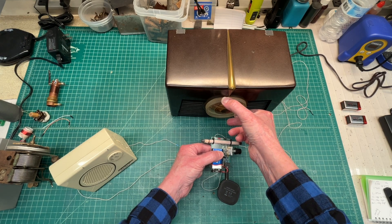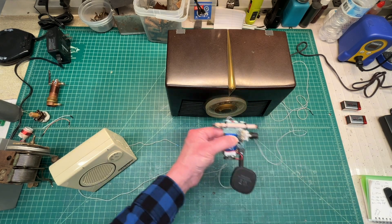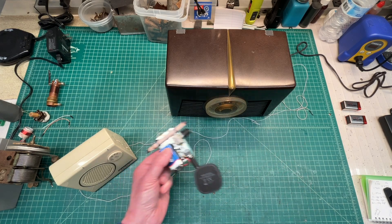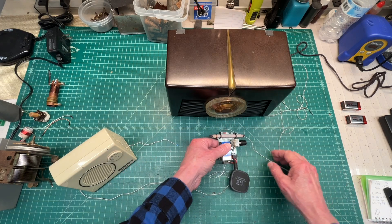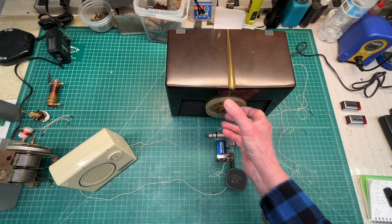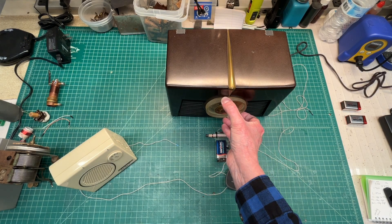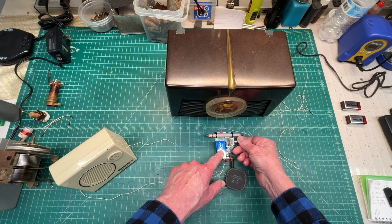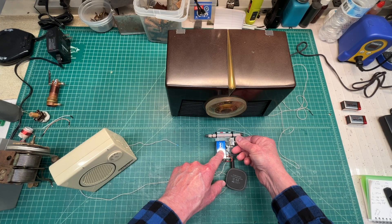As you can see in the demonstration, the local oscillator of the old tube RCA Victor is a lot stronger in amplitude. Thus, the signal is a little stronger in close proximity back to the ferrite antenna. The signal is not as critical as it was using the little solid state receiver local oscillator.